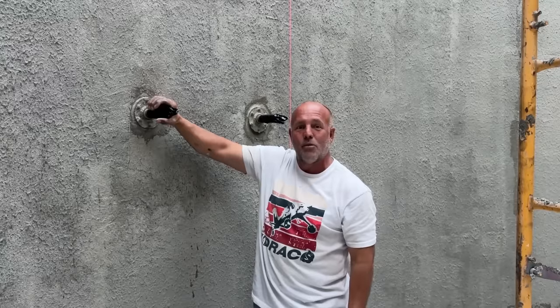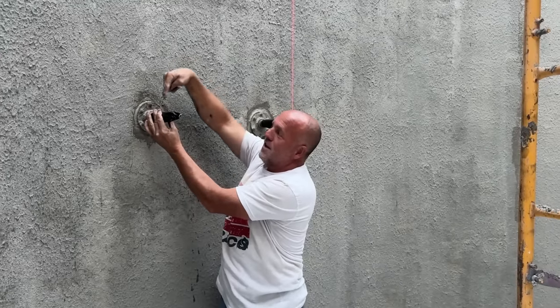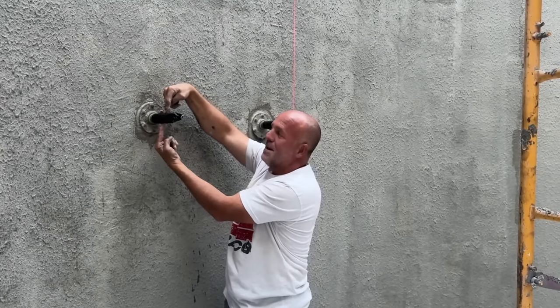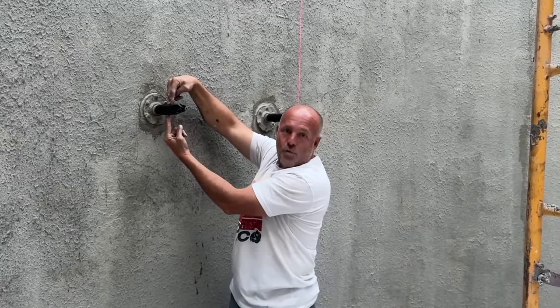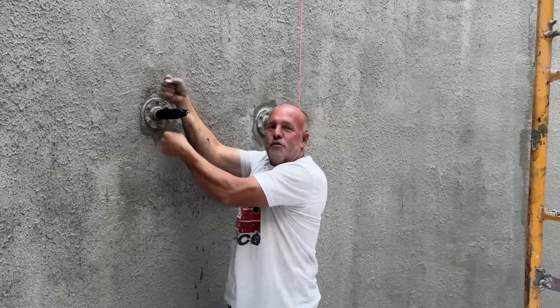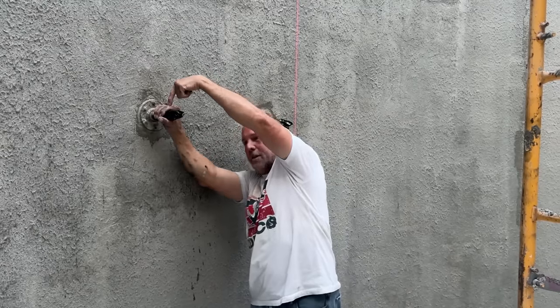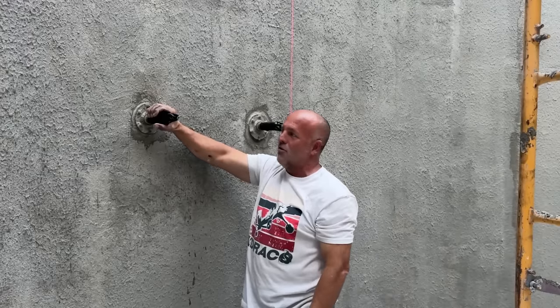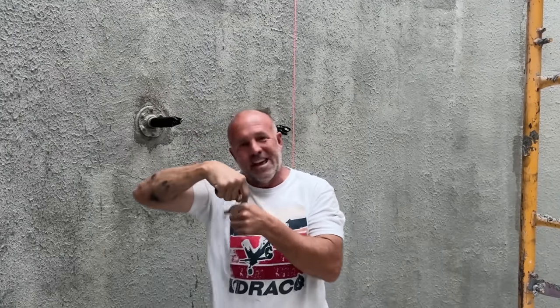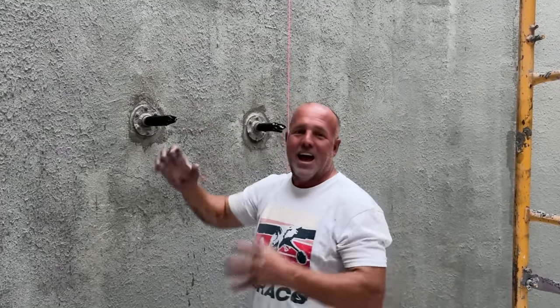So you would think it would be wobbly. It feels wobbly until the whole thing goes on. But since I put the holes in the top coming down for the pins that pin the ladder, the pins are perfectly drilled with no play. And so when you grab the ladder, you can't move it any direction other than up and down because the pin is going this direction. So this big play pipe can move up and down on a pin, but it can't move in and out or side to side because it's the exact same drill size. Hope that makes sense. When it goes on, I'll show you what I mean, how much play it has, but you can't move it any direction, but you could move it up and down on those pins.